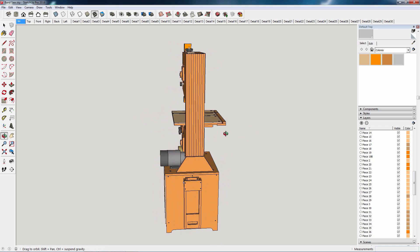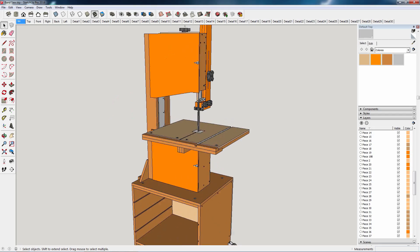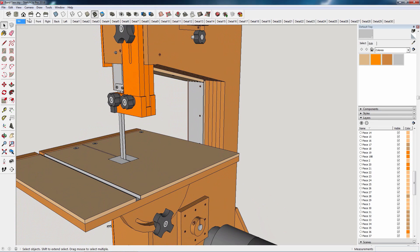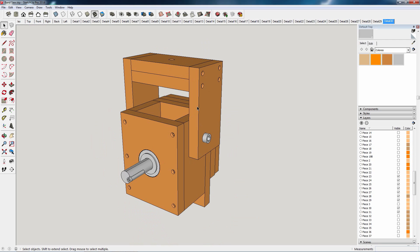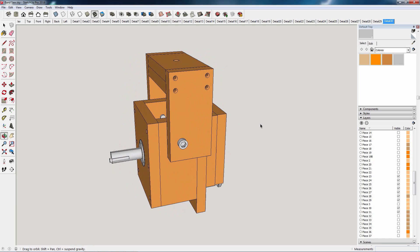It's completely made of plywood, to make the assembly easier. Once the plywood parts have been cut to size, we'll basically only have to put them together following the plans. I'm going to use birch plywood, although we could also use lighter plywood or MDF. At any rate, it's best to use hard plywood for load-bearing pieces, such as the upper wheel's lifting system.